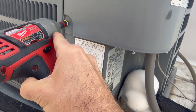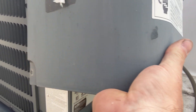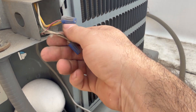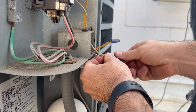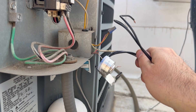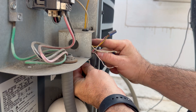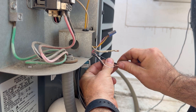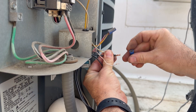The tenant will still be able to run their AC when it's cold out for a bit, and most of the time they won't even notice it's turning on and off. Here are our low voltage wires — a 24 volt and a 24 volt common. It doesn't matter which one you use; I'm going to use what I believe is the 24 volt common. My contactor just turned off. I'm going to run these wires up through here and mount the switch — one wire to each end. I'm doing the non-live side first.